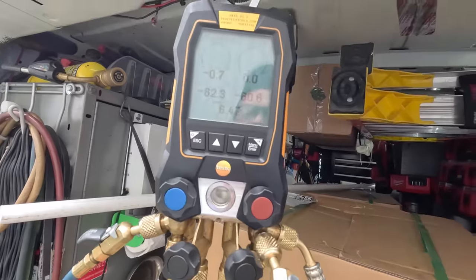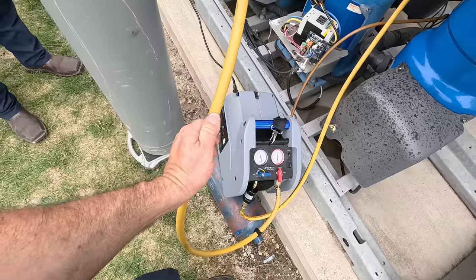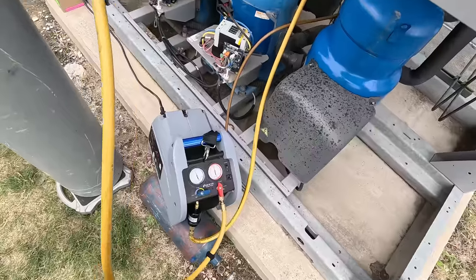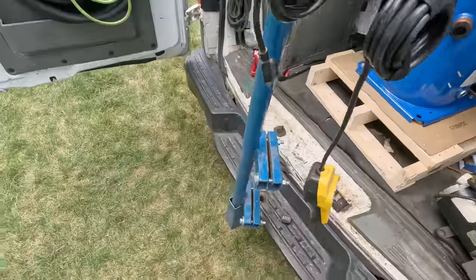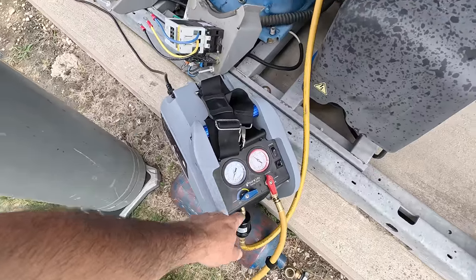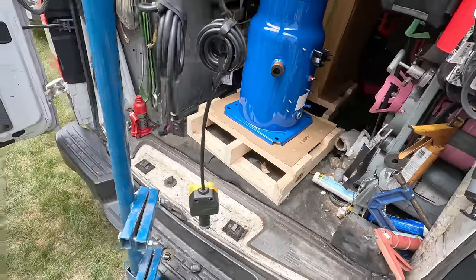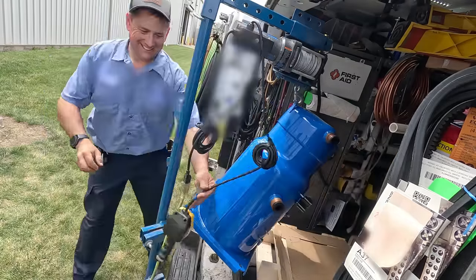We're just going to do it like normal. We're at a whopping six and a half pounds, which I don't feel is really all that big of a deal. We've valved it off multiple times making sure we're going the right direction — there's no check valves. We're coming out hot on the discharge; if I close my valve here it raises the pressure, if I close it over there it goes to zero. So this is my ladder piece — the six-foot, eight-foot, ten-foot ladder section and the handle for it. This slides back and forth and has a little play in it. We're going to use this to lift her up, drag her out, and rotate her around. We're pretty much down to zero-ish — just a little bit to go to make the old EPA happy. 46 pounds, so we've lost a little bit. We're going to take this off the pallet to make it a little easier to maneuver.